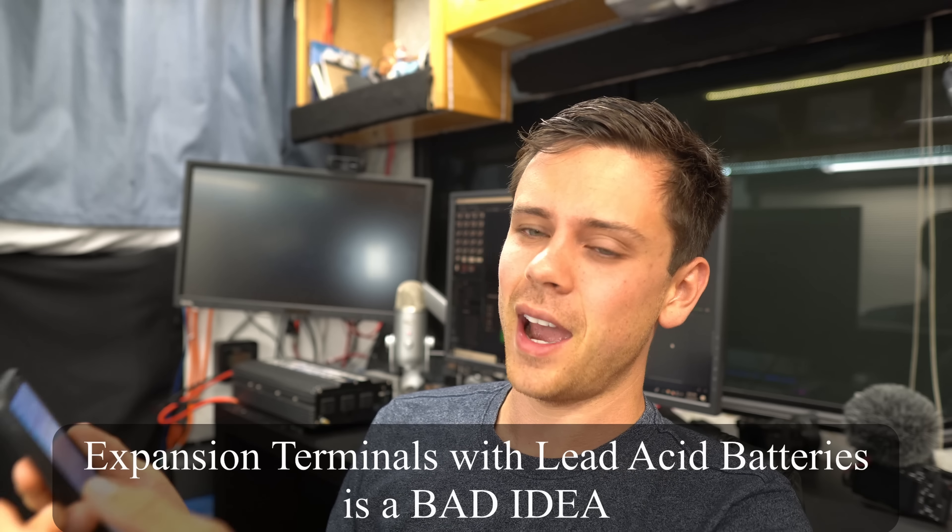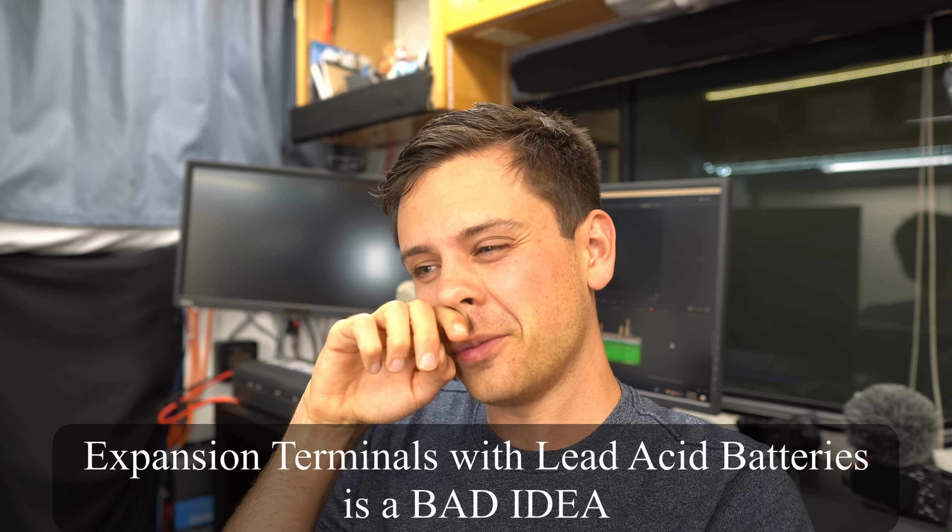I have some EC8 plugs in my backyard and I'm going to leave them out in the sun for a couple of months and report back with a picture in the community section. I've used lots of plugs outside on RV roofs over the years — RC hobby airplane plugs, EC8, XT60, XT90 — and they do not like being outside. The next con: using the battery expansion with lead acid batteries is a joke. Charging only to 12.6 volts, no temperature compensation, and discharging down to around 9 volts will kill lead acid batteries.